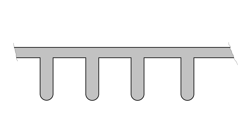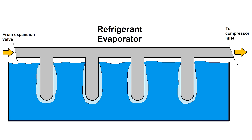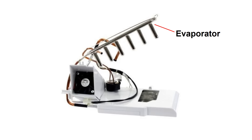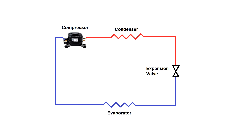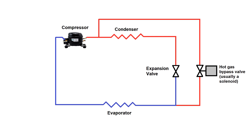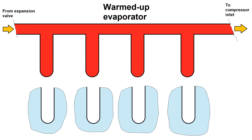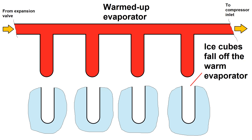The first approach I used was to imitate the mechanism of a countertop ice maker. These have an evaporator shaped like a row of fingers, which are dipped into liquid water. As the evaporator pulls heat away, ice freezes around the fingers. The trick is in releasing the ice, since once frozen it's stuck to the evaporator fingers. Ice makers have an additional valve that allows hot, high-pressure refrigerant vapor to bypass the condenser and throttle and go directly into the evaporator, effectively turning it into a condenser, causing it to rapidly heat up and melt the ice in contact with the fingers — releasing the ice cubes and creating that distinct ring shape.